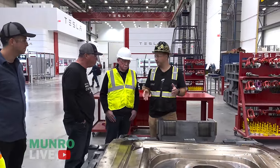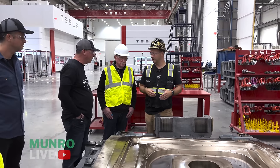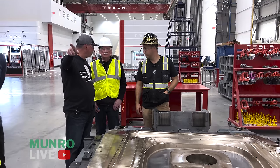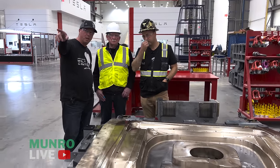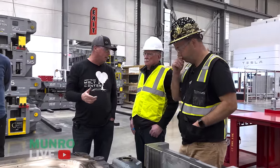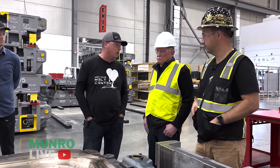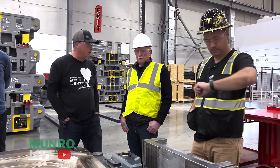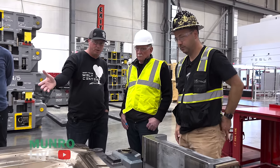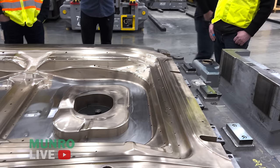We have what I believe is the world's fastest, first-of-its-kind high-speed A-class surface stainless press, making 10 strokes per minute. We do eight panels — inners — as well as tailgates, hoods, four doors, lamp cans, and similar parts. At 10 strokes per minute that's roughly 600 parts per hour. This is the front door inner — large format, dual-part — and this is the draw die showing the upper and lower halves.